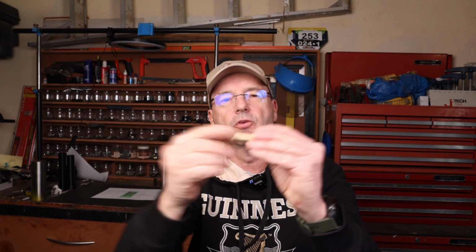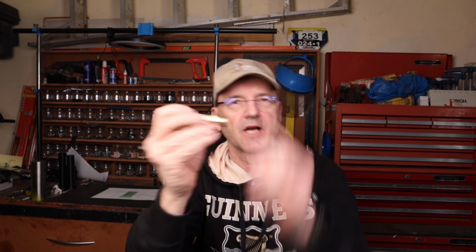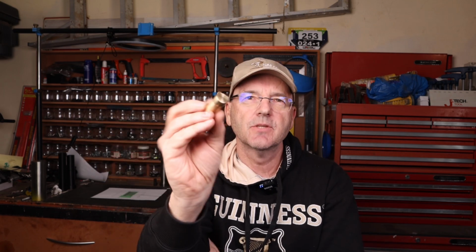So guys, that's the plunger over there. I think it's a better design than making the whole thing in one go, because this is obviously replaceable, and should I decide to change the inner diameter of the actual chamber, I only have to make this again, not the entire connection shaft to the pneumatic ram. And it's made of dissimilar metals, so it should resist getting jammed inside the chamber itself.